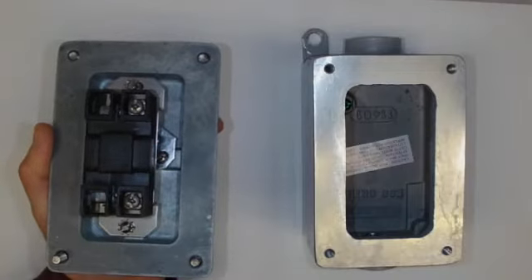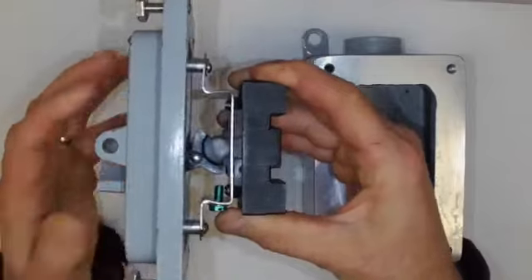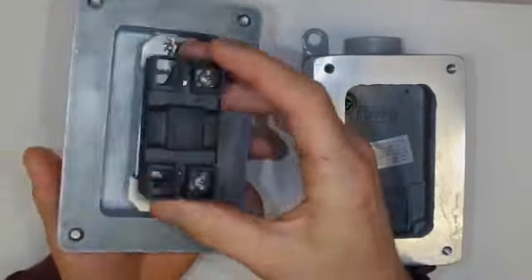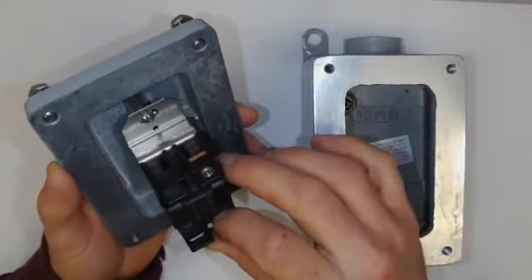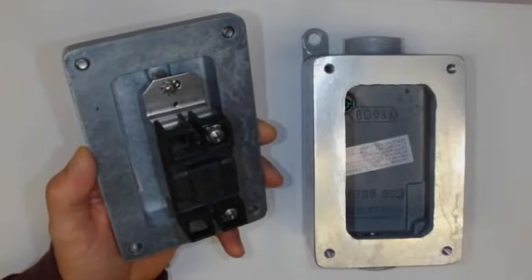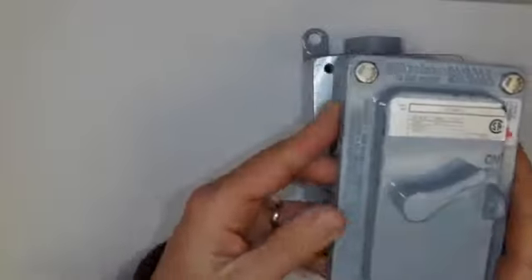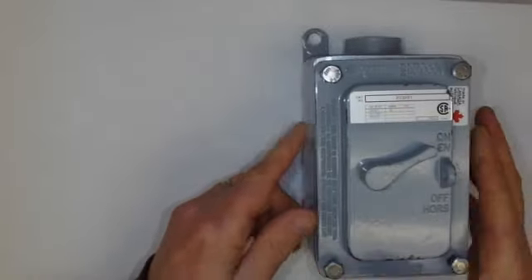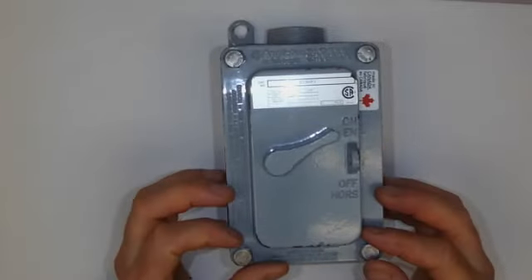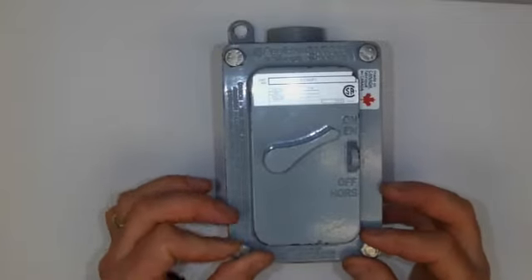It's pretty basic technology — this is simply a heavy-duty light switch, that's all it is. We're not preventing gas from getting to it or anything; we're assuming there's going to be an explosion inside this housing at some point. There are four quarter-inch bolts, and they need to be tightened and torqued. If they're not torqued to the right rating, the system might not be explosion proof.